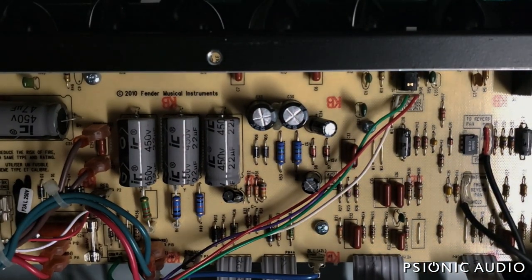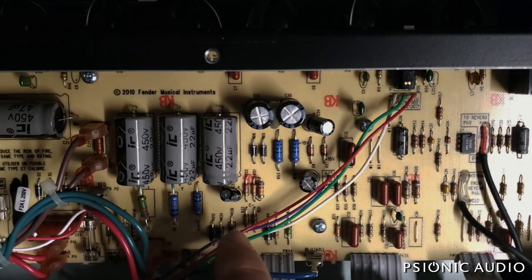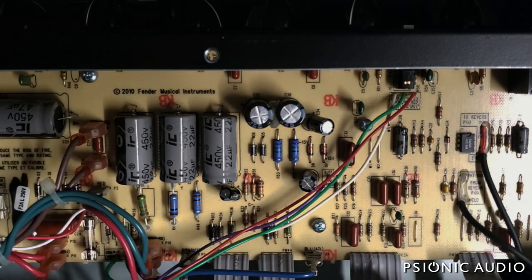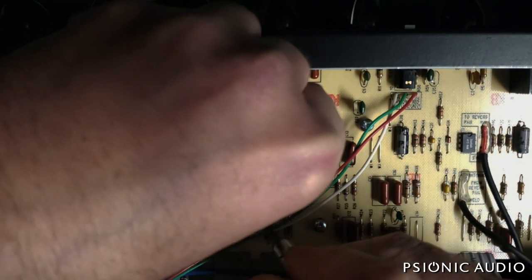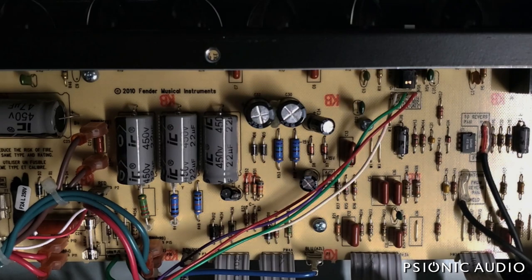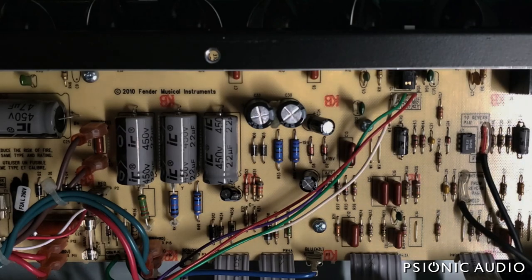Dirty secret: if you need to get a little piece of metal off the board, just lick your finger a little bit and the piece will stick to your finger and come off. If that oogs you out, you can follow up with some alcohol. So I've got this piggyback resistor in there across it, and I know from doing my math that with parallel resistors, 82K and 33K gets you right about 24K. Someone will post the actual value — 23.7589 or 24.34 or whatever — but unless you measure the actual resistors you're using, it's kind of meaningless. You're going to be around 24K, and it'll be as accurate as sticking a 24K resistor in typically.